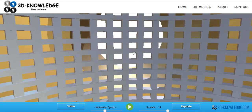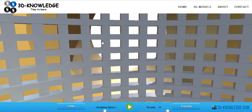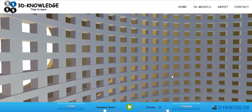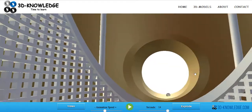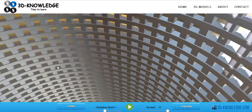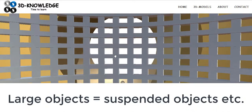These perforations are only going to allow objects to flow through that are smaller than these squares. So if you have big plastic bags or seaweed or whatever else depending on the system, they'll actually be contained within this space — contained within the strainer. You can see the shape again: all the fluid flows in this direction and any large objects will be contained within the strainer, sometimes accumulating at the bottom.